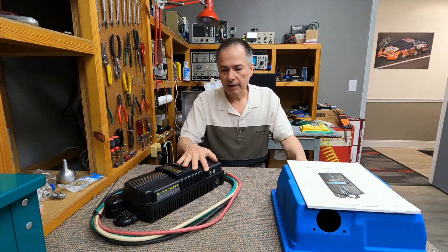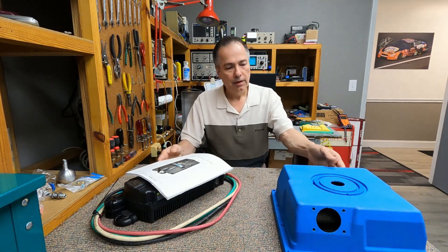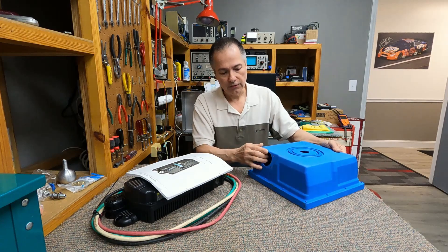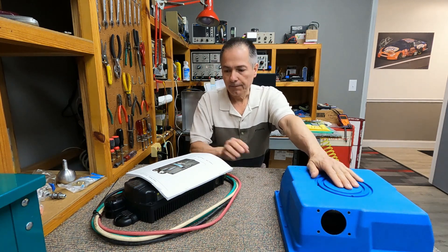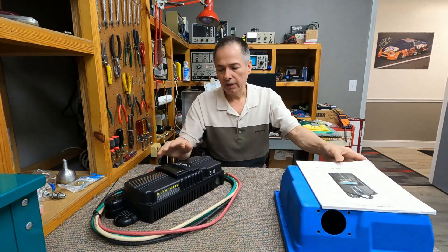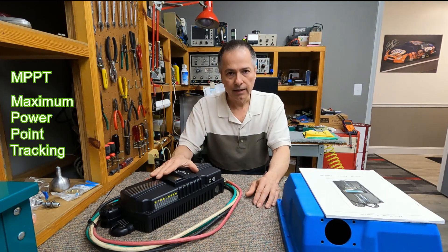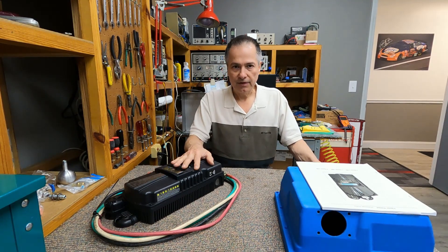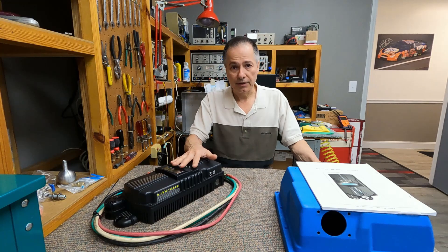This time I want to go over something I learned on the last test. I was using this cheap blue housing and we learned it's very flimsy and not reliable. I did do some tests on this trying out the different functions of the charge controller, mainly the MPPT — maximum power point tracking. This function is very useful but not the most efficient by default. It's programmed to do a power sweep every three minutes, but with hydro there's no need to do additional sweeps once you've already established a point.